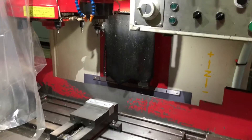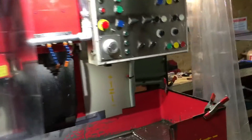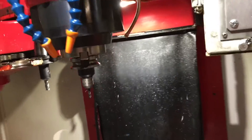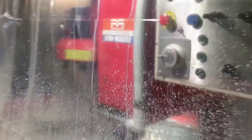Another thing I did was add an insane amount of light — I like lots and lots of light when I work. I went to Lowe's and got these LED work lights: one is about 1500 lumens and the one in the back is about 900 lumens. I machined an aluminum block to hold the actual LED, put magnets in the back of the block so I can stick it anywhere, then mounted the ballast inside my cabinet. The net effect is a tremendous amount of light for the machine, which I love.